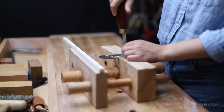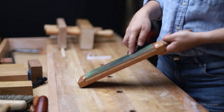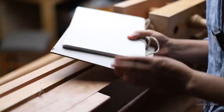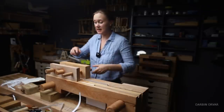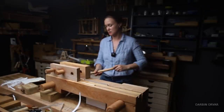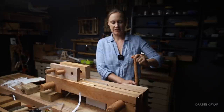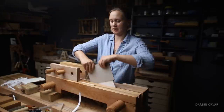This blade — I think it's definitely nice to strop it, to put it onto the leather with a little compound and do that before you set the jig up. But once you have that, it actually stays sharp for quite some time, and I don't think you'd need to put it to the stone until you've cut a lot of books. These rods here are actually the same ones you can use to open up the vise — they plug right in, so they're kind of multi-purpose so that you don't need to have multiple rods around.